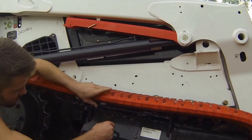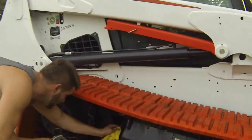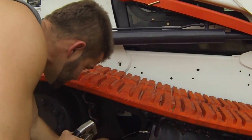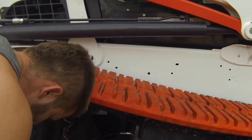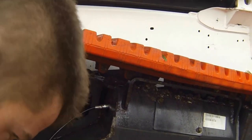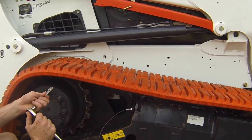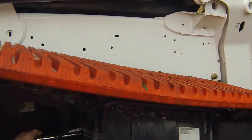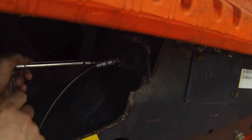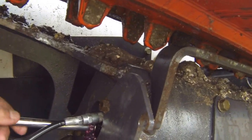We want to see a gap here, and ideally we want it a little less flexible than that. So now we'll go ahead and apply some grease. I'll also loosen the bleeder just a small amount to flush it. And what you'll see — get close in there — you'll see goo just coming out right there. We'll go ahead and tighten it back down.